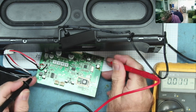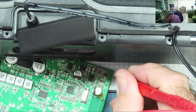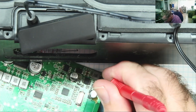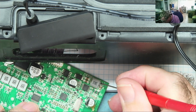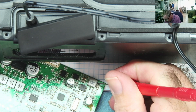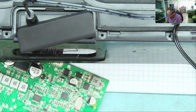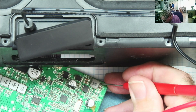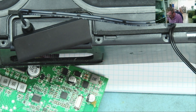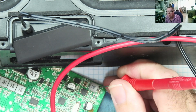So I would expect to have more voltage here. Now I think this is where he said he didn't get any more voltage. Getting grounds is a bit awkward on this one. I think that'll spark. 11 volts. Just get to the end there. Yeah, 11 volts. I think I'm actually just accidentally cutting the end of that — I need to be careful of it. Pretty much what he says: you get 11 volts on there regardless of whether the charge is attached or not. Power supply off. We'll just check the voltage again — power supply off. Here we have 11.24.